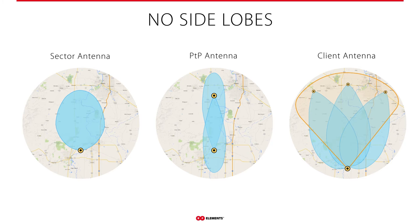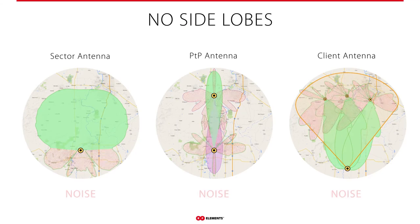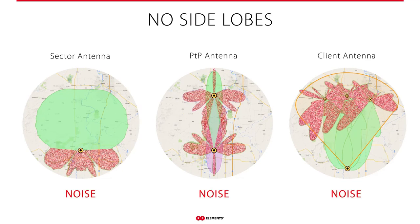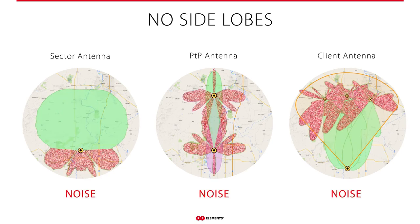The key is to choose the antenna technology you want to use, but truly understand how those antennas work. If you don't, you won't be able to plan accordingly — you won't know the distances that side lobes are capable of transmitting and how they interact with your other towers.